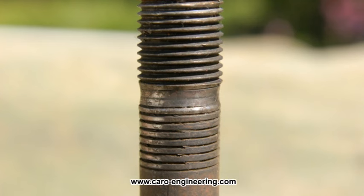Hopefully the parts will be replaced before they look like this. Of course, there should not be threads in the area of the bracket. The grip of the bolt must be long enough so that the thread is outside of the bracket, or the bearing strength will be much reduced.